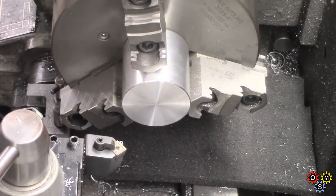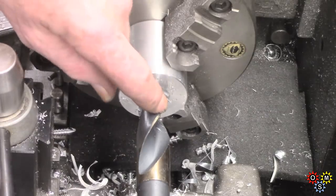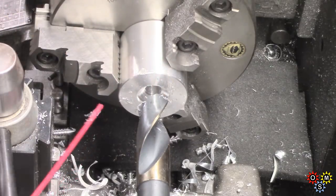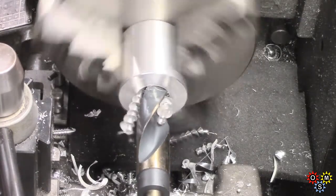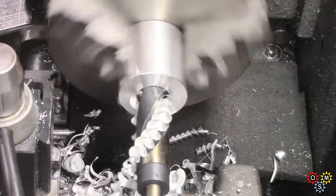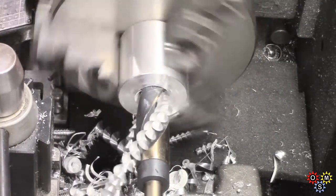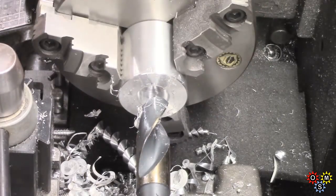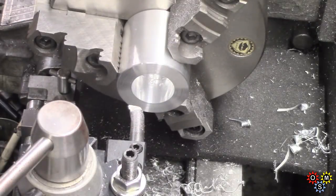Right, it's not too bad and we can probably just pop a quick chamfer on here whilst we're at it. Now we've got to do some drilling first. We've got a half-inch starter hole — just going up, this is 15/16ths actually. My inch drill is not quite good at the moment, it needs a tweak. Just to open it up and then we can get boring on it. I'm in back gear at the moment. I've got quite a way to go yet. I'm taking about 20 thou and of course we get a great big twist of chips coming out.